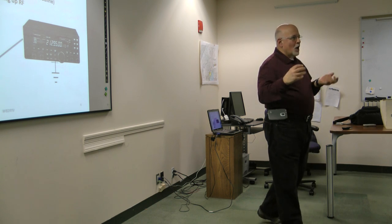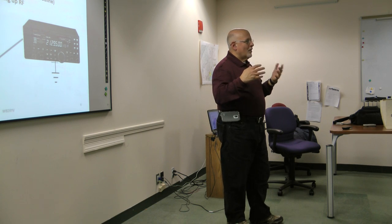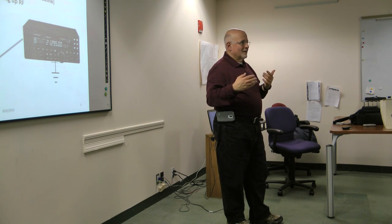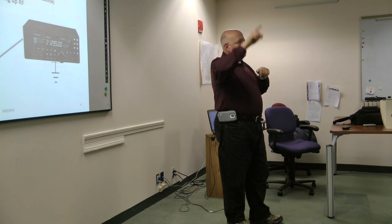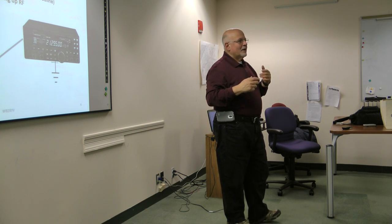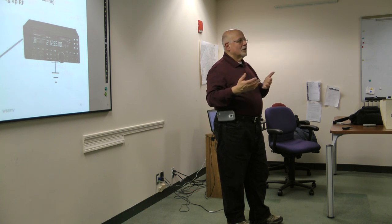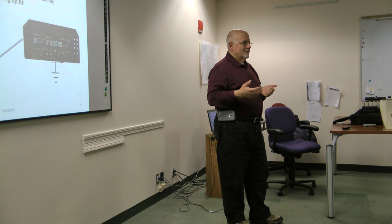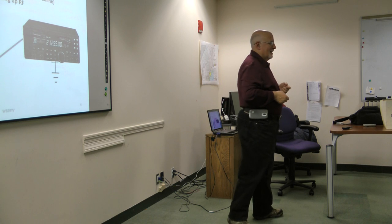And the answer is no, because all that wiring in your house to RF looks like a high impedance typically. You've got coils and you've got stuff running every which way. It typically looks like a high impedance, so the RF is not going to go down that path. In fact, what it may do is just start setting up some loops inside your radios, things like that.